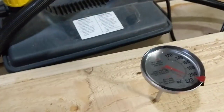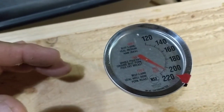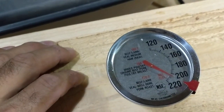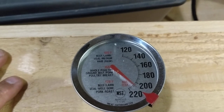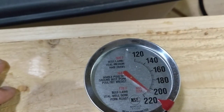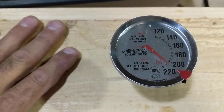So I got some time to kill, so I'm doing another project. Just a quick thing on steam bending: 210 degrees is where you're at for steam bending. I'm new to this so I can't give you exacts, but they say an hour per inch of thickness of wood. We're inch thick by inch by inch, so I'm going to leave it in a little more than an hour because I've got a decent size bend to make.